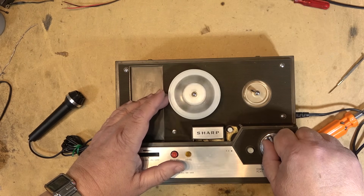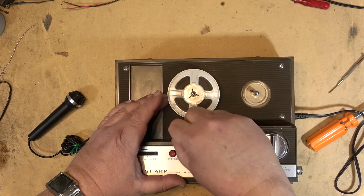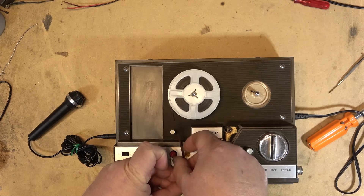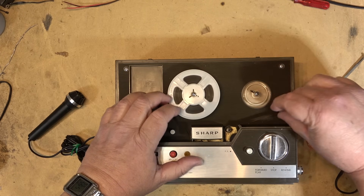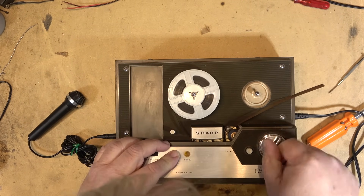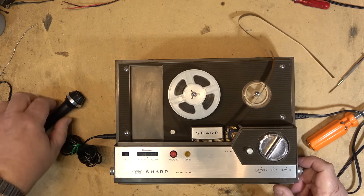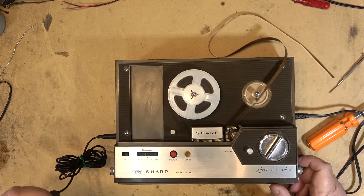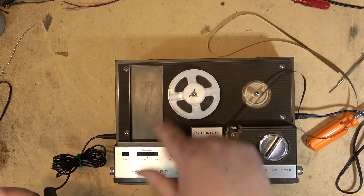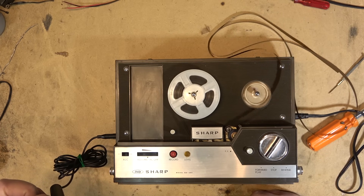So that works. We'll try the slower speed — we'll just take the capstan sleeve off. This holder is what the capstan sleeve stores on when you're not using it. The tape probably isn't supposed to go around it, probably just like that. Okay, we'll try recording now — it's not pulling the tape at first, but there it goes. Now we're recording at the slower, lower-quality one and seven-eighths IPS — double the recording time. I'll have to try to find that little reel for this tape recorder. It's from 1965 and it works.